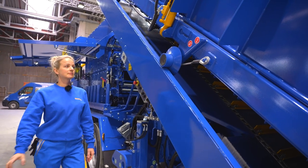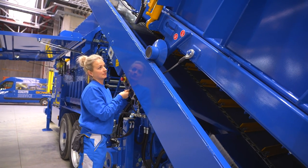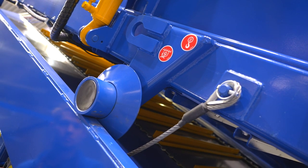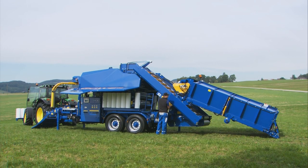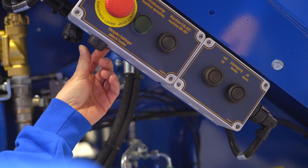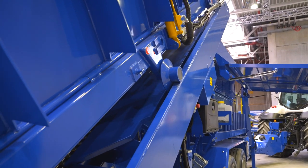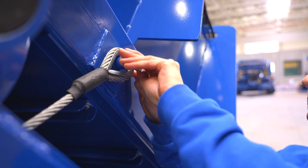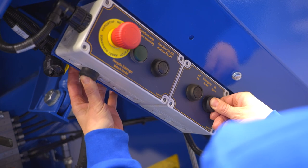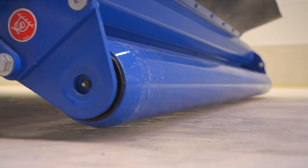When driving on the road, the feeder is secured using two steel cables. The feeder must be moved up before they can be released — press the UNLOCK FEEDER and FEEDER UP buttons at the same time. To prevent the feeder from rolling backwards, it is essential to release the buttons in the correct sequence: first release the FEEDER UP button and then the UNLOCK FEEDER button. Now detach the steel cables starting on the right-hand side of the machine, followed by the one on the left-hand side. After removing the steel cables, do not allow anyone to remain in the area behind the feeder. Press the UNLOCK FEEDER and FEEDER DOWN buttons to lower the feeder completely. Ensure that the support roller rests on the ground across its entire width.